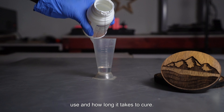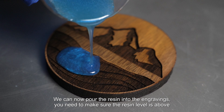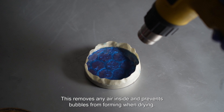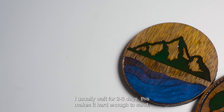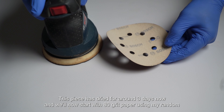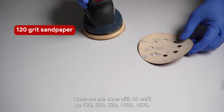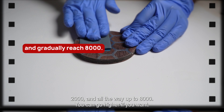If you have designs that come over the edge, you will need something to stop the epoxy from flowing out. I'm using some masking tape since the gap is not large. You could also use hot glue along the edges of your design if they are simple ones — this will save you time when you sand the excess epoxy later. Now let's mix up some epoxy. The container usually comes with instructions on what proportion to use and how long it takes to cure. You can also add dyes depending on the color of the wood you're using. Pour the resin into the engravings and make sure the resin level is above the surface, because the resin gets absorbed into the wood and you wouldn't be able to sand it. After pouring, we'll use a hot air gun and heat it up a bit — this removes any air inside and prevents bubbles from forming when drying. Once the pour is done, we need to let it cure. I usually wait two to three days, which makes it hard enough to sand.